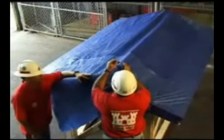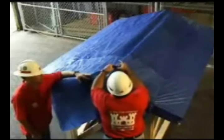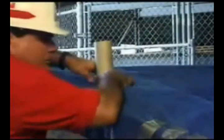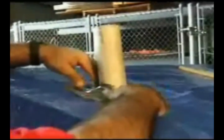Step 7. Plastic sheeting must be closely fitted around pipes, conduits, and other protrusions. The area surrounding any protrusion shall be sealed by using small strips of plastic to form a collar, sealing this collar with butyl rubber tape when available, or any other approved sealing tape. This sealing tape is applied along the entire perimeter of the collar to ensure a good moisture-resistant seal.